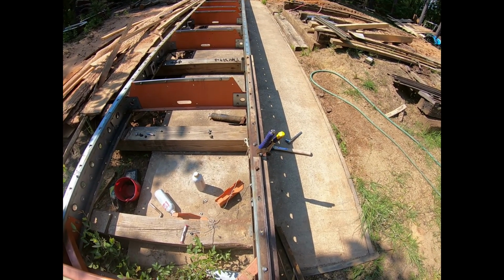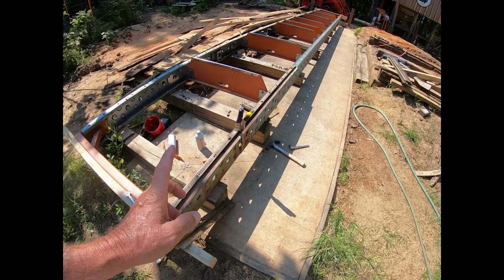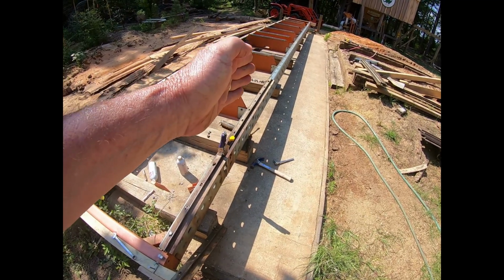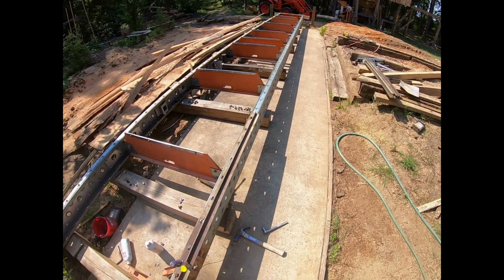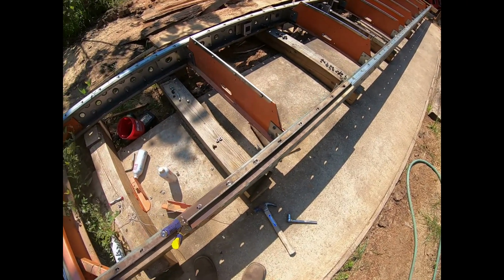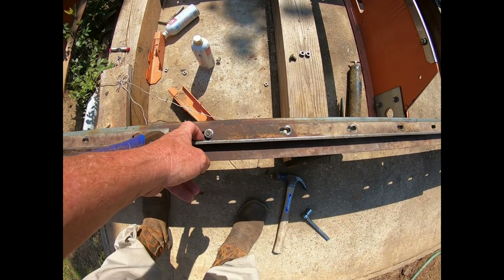One other thing, as I go along, I'm using that ratchet wrench for two or three per thing first, rather than that air wrench, because a lot of times when you go to crank it down with the air wrench, it'll actually move that thing one way or the other. But you can see now how I kind of got it.